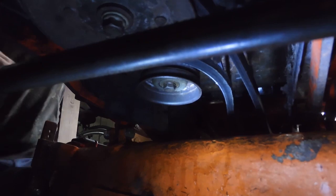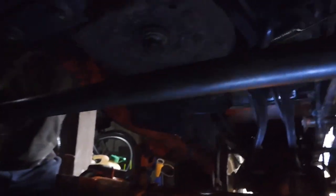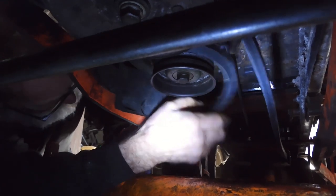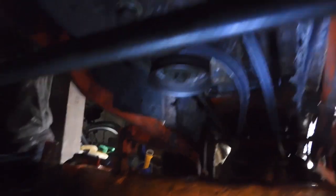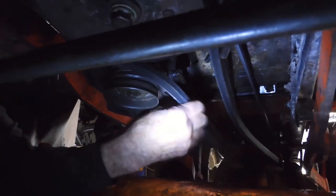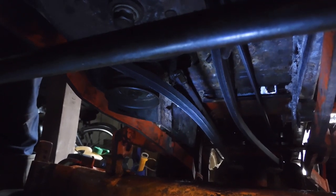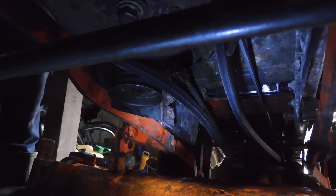I'm just going to let the deck down. The deck's up here. And the belt — look. That's a 69 inch belt, a 69er. You need a 68, just to take an inch out of the length. And then when it's in the idle position — when it's off — it's just loose. Look. That's a 69er, it might take a 67. There's no problem with the strength of these belts up against the manufacturers' — they're good as gold. And at 10 pounds against 47 pounds, I think it's a good buy.